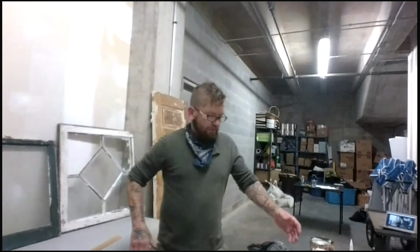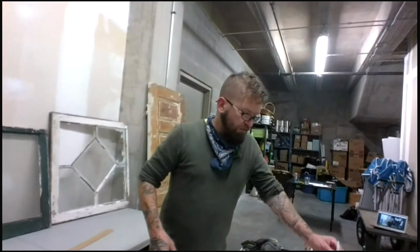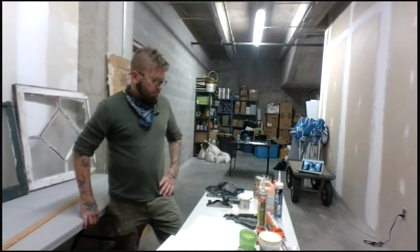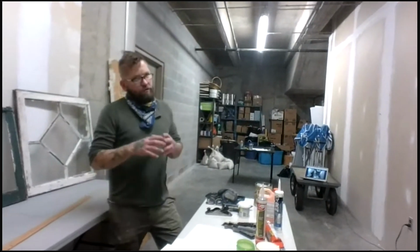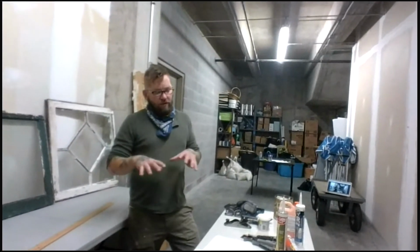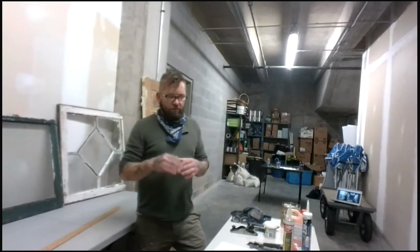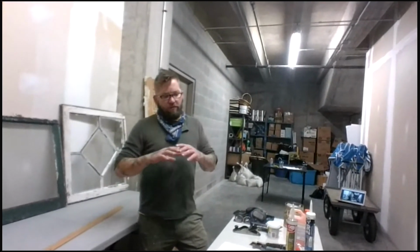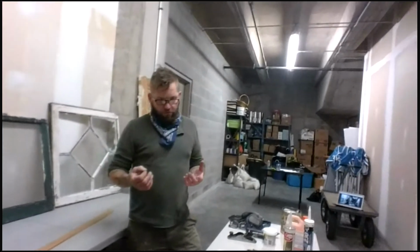And well, I mean, using caulk and checking for any gaps on the outside or inside of your windows that could be refilled with painter's caulk is also another thing that goes with maintenance. And always be sure, if there's any old caulk or glazing or wood putty or anything else when you're maintaining your windows, that you clean all that off first. When you apply your new caulk, new glazing, new weather stripping, you want to make sure that all the old stuff is gone completely so that the new stuff will adhere and do what it's designed to do.